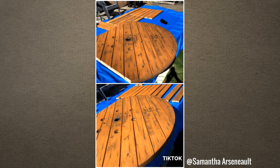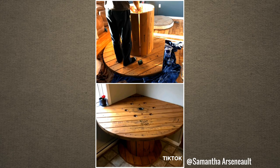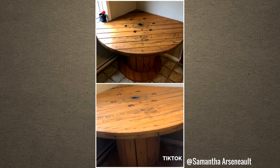To create a corner table for your kitchen, you can dismantle your wooden spool. Then cut one of the circular parts to fit the corner of your kitchen. Next, cut the other circular part into a smaller size because you'll use it as the base. After that, sand the pieces down thoroughly so that you can stain or paint the wooden spool. Then assemble them.